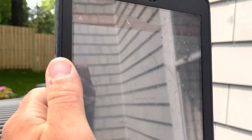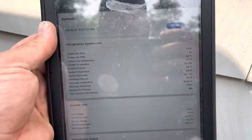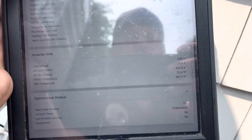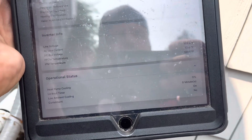And then it'll load up. It's not in real time, but if you keep hitting refresh it will give you your pressures, temps, voltages, amperages — everything. I have to stay within 10 feet of the equipment. It'll give me air fan RPMs, compressor, suction pressures, line set pressures, temperatures, line voltage, DC voltage, operational status. It's only been on for zero minutes, so let's just let it run. That's how this Bluetooth connects.